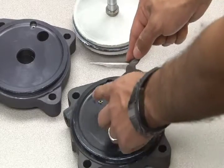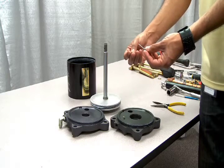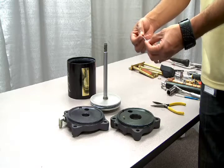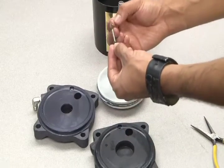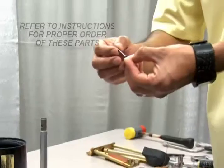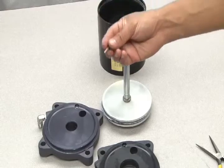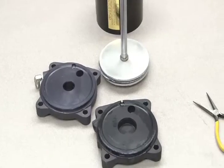During replacement, apply Haskell lubricant to the pilot stem port. Then use the old pilot stem to stack the new replacement parts. First, put on the star washer, followed by the bronze backup, and last is the O-ring. Be sure to refer to your instructions for proper order of these parts. Insert these parts into the lubricated hole in the end cap and use a hammer to set them into place.